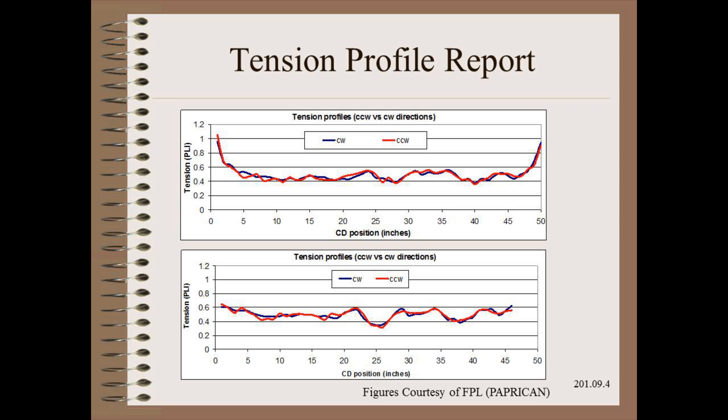There is a challenge that is unique to unique sensors — by this I mean, how do you test the goodness of this baggy web sensor when there are very few devices to test it against? One way to begin to establish trust is to see if the instrument is repeatable. In the top figure, the measurement was repeated on the same web twice. Note how the two repeats line up quite closely.